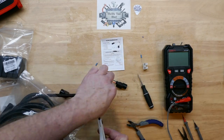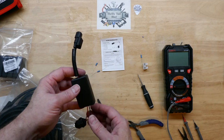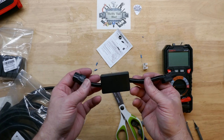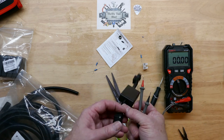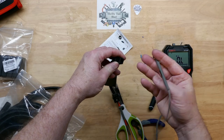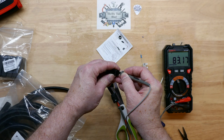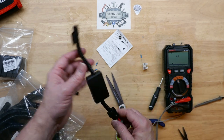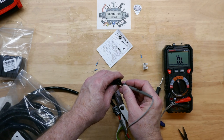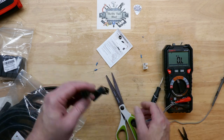I'm going to go ahead and cut some of this tubing — it's split so it just slides on and will also pop off easy, but we can put some 3M 33 Plus tape around the edges to tape it up well when we get ready to install this permanently. I do want to go ahead and ohm it out and make sure the connections are good. The black wire should have the 82 ohm resistor in line with it — and yes, 83 ohms, perfect. While I'm at it, let's go ahead and make sure the red wire is making a good connection since I did not crimp the wire on these ends on the connector.